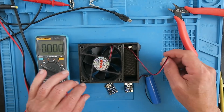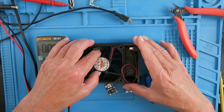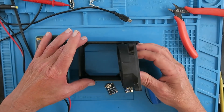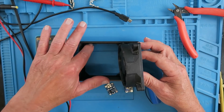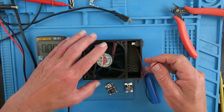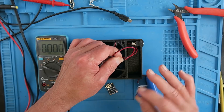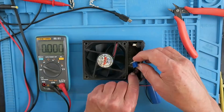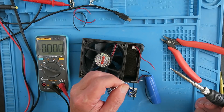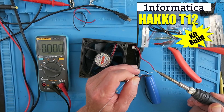There's a good length of cable on the fan so we should be able to wire up everything we need. We just need to make sure that we will be able to remove this as we need to bolt in the filter cover. I'll guesstimate how much cable we need for that. This cable is clearly going to go on the output of our boost converter, which is going to sit in the bottom there.